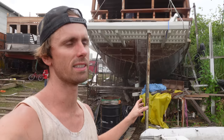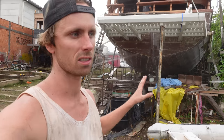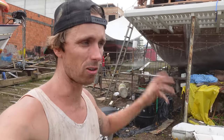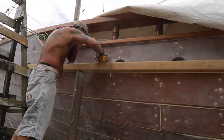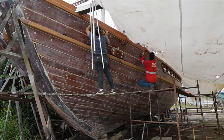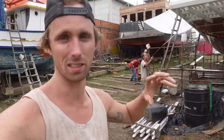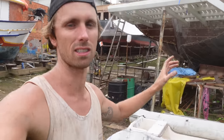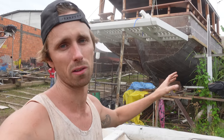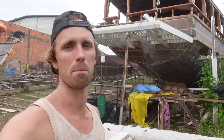Yabá is now entirely sanded down, all the epoxy is scratched and looks completely white and matte. So Nico is going over it now, as you can see behind me, with a weak power hose to get the majority of the dust off, because it's so dusty. The amount of sanding we've done is absolutely insane. Before we go over it with a cloth and rubbing alcohol to get all the dust and grease off, we just wanted to hose this down properly to get the majority of this epoxy dust off. We're gonna let it dry over the weekend. Monday we're gonna come here, wipe all the remainings down, and start applying the base layers.